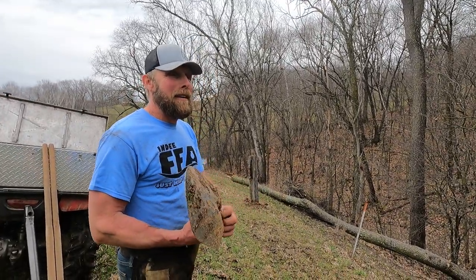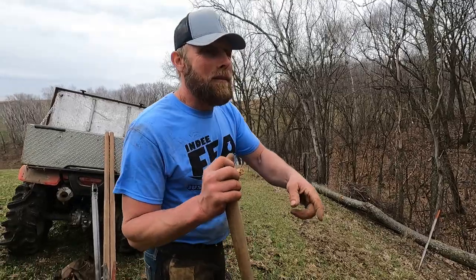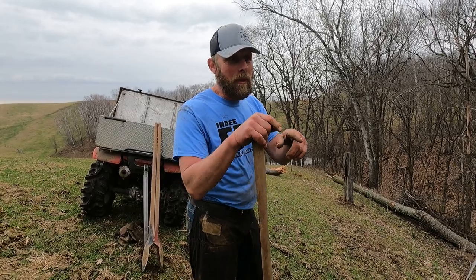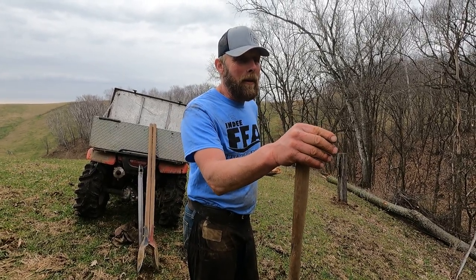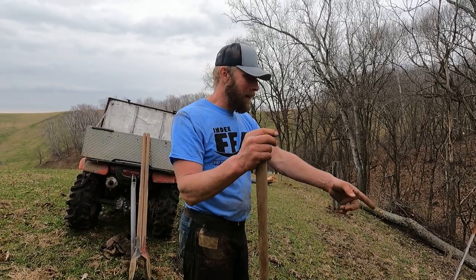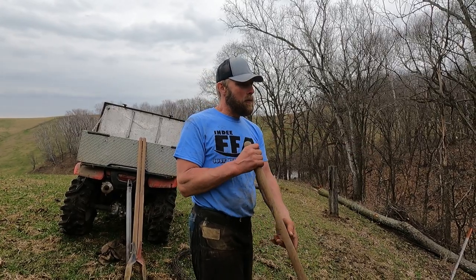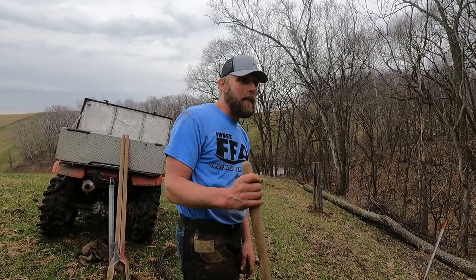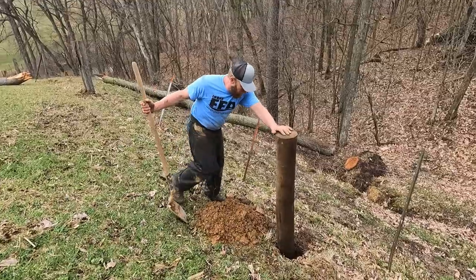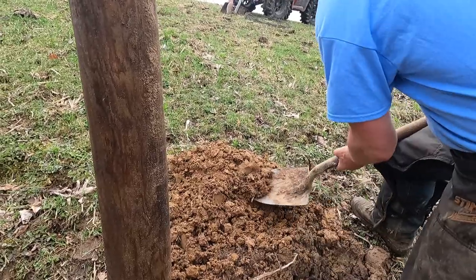And this clay, it's so sticky and muddy. So if I had a choice, like sometimes we dig out this heavy wet clay around the barnyard when we're gonna really want to plant them posts for a gate, I'll bring like a 5 gallon pail of gravel along or something you can dump in. It really seats it in nice. This clay ain't gonna run down them holes, but it won't matter up here. Or sometimes they got a sandbank nearby, you get a few scoops of sand, get it down in the bottom of the post, and you can pack it in real nice and tight and leave your clay up near the top. This stuff's some pretty sticky stuff. But we're gonna kinda push them uphill a little bit as we plant them. I don't think we're gonna get a whole lot to run down the hole.